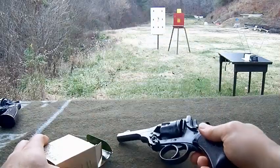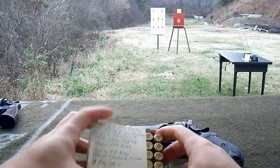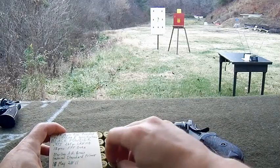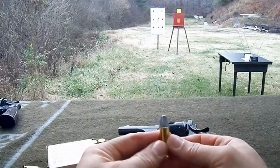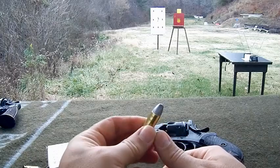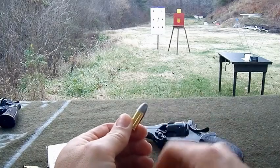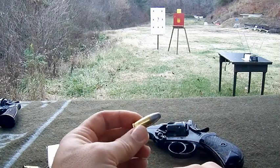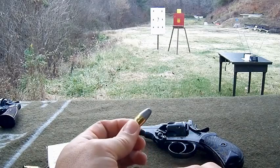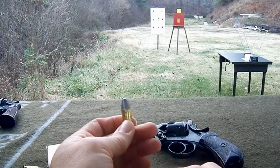What I've made is sort of an ersatz Webley cartridge using 45 auto rim. I cast a 265 grain hollow base bullet. It's a mold that duplicates the original Webley bullet. Very hard bullet for me to cast. I'm not an expert caster, and I have a lot of culls and a lot of rejects. But when they turn out well, they're a good bullet indeed.